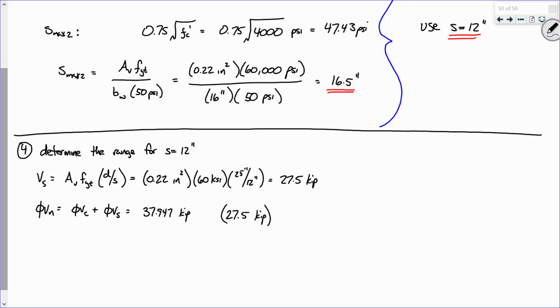Did you say 0.6 for von Mises? No. Do you remember this? Phi is 0.75 for shear. So what is this going to be? 58.572. Well, you tell me. What did we calculate phi Vc to be? It was like 50-something for Vc by itself. Yes, so I could have used the other one and just multiplied the whole thing, as long as I account for it.